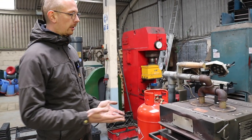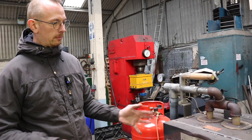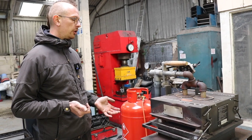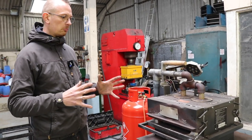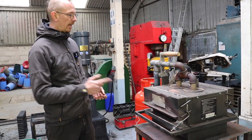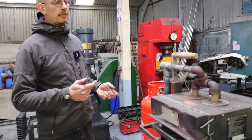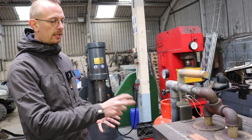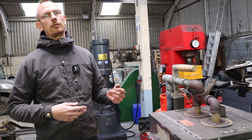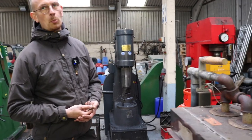But a gas forge is much more comfortable, also to me. I have a gas forge myself, not a big fancy one like this, but it's actually not much you need. So the setup is quite small that you need to actually start forging. But that makes it very comfortable. It's also easier to use once you set a temperature or the gas flow, then you don't necessarily overheat the metal. So it's really comfortable to use. Excellent stuff. So I'll let you begin, Oliver.